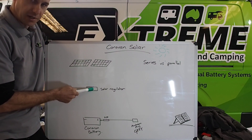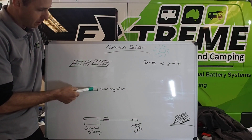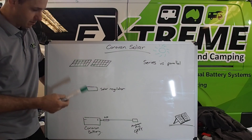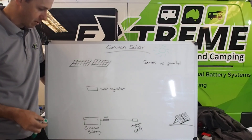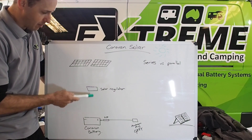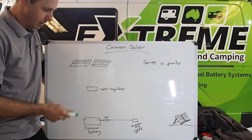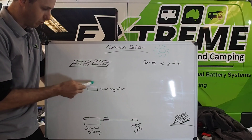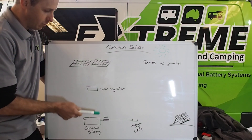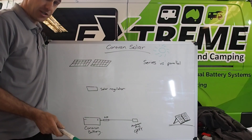But if you take a measurement at the battery output during peak sun in bulk mode, it'll read 14.4V at the regulator. Well, it's not 14.4V at the battery. It's proven time after time — I've had my multimeter on batteries for years and noticed there's always, especially with only 6mm cable, a bulk voltage drop between the regulator and the battery. Because the regulator's job is to charge the battery, and it only knows what it's programmed to do.